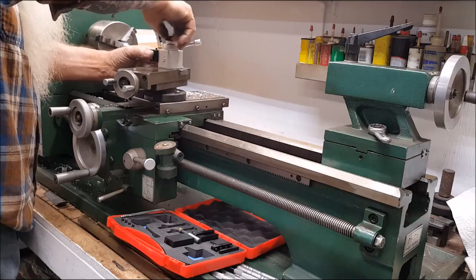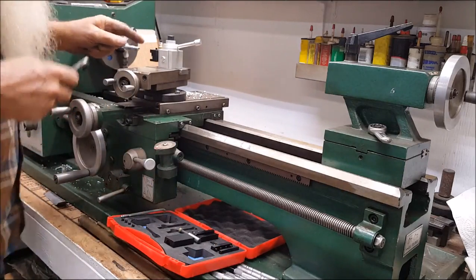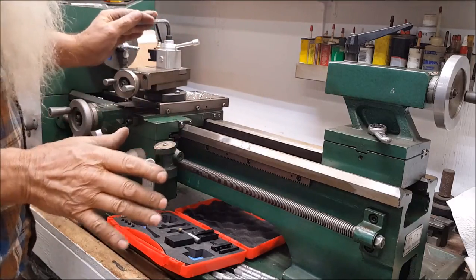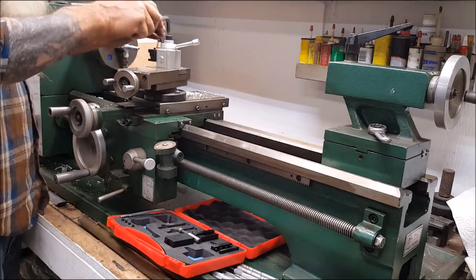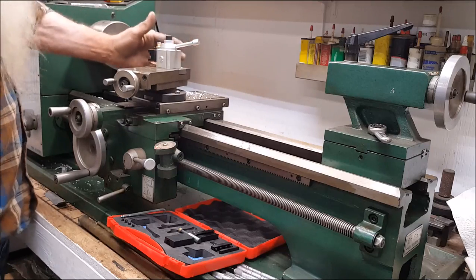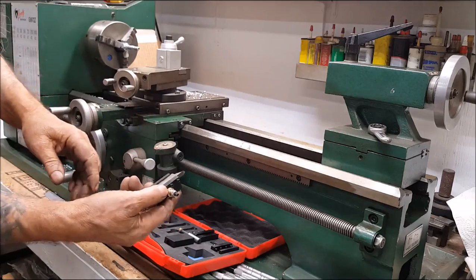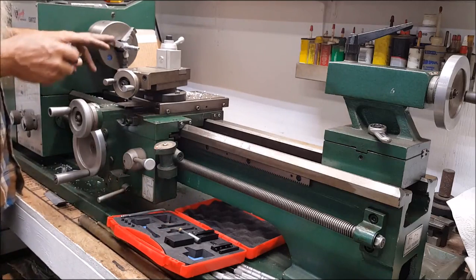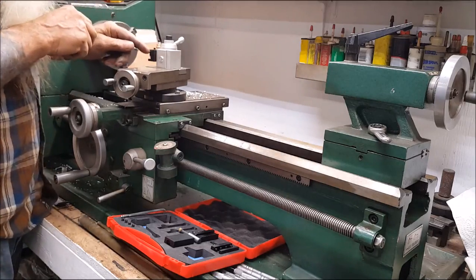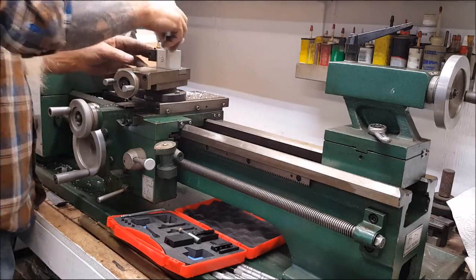The reasoning behind the thought that I would need that on this lathe, being such a small size, is that possibly I was going to be doing a lot of turning of round material that was less than, say, 3/4 of an inch up to 1 inch, because that's the clearance that I have on the closest point to the stock on this tool post. And the beauty of it is, there's your little quick change things, and to put a 1/4 inch bit on here, the center line of the material was a little high, so I just put a riser in there, a 1/4 inch bit, just freehand ground.